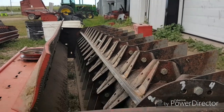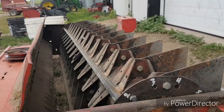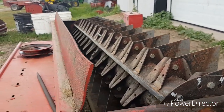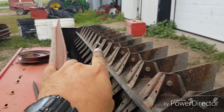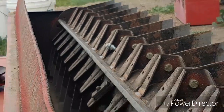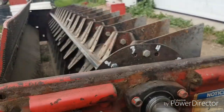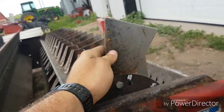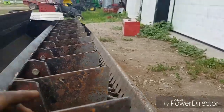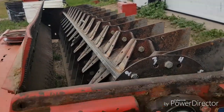So they stiffened it up and balanced it at 2,000 RPM to within 2 grams, so it shouldn't vibrate anymore. You can see down there in the middle there's a shiny new weight, and they've got a few all over the place. That's all done and balanced. I put these new hammers in last year along with new stationary knives, so it's going to be a brand new chopper.